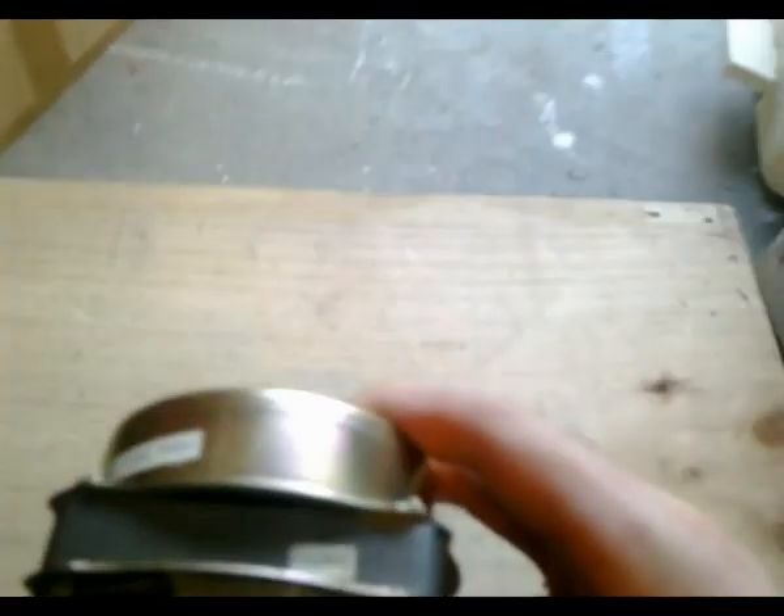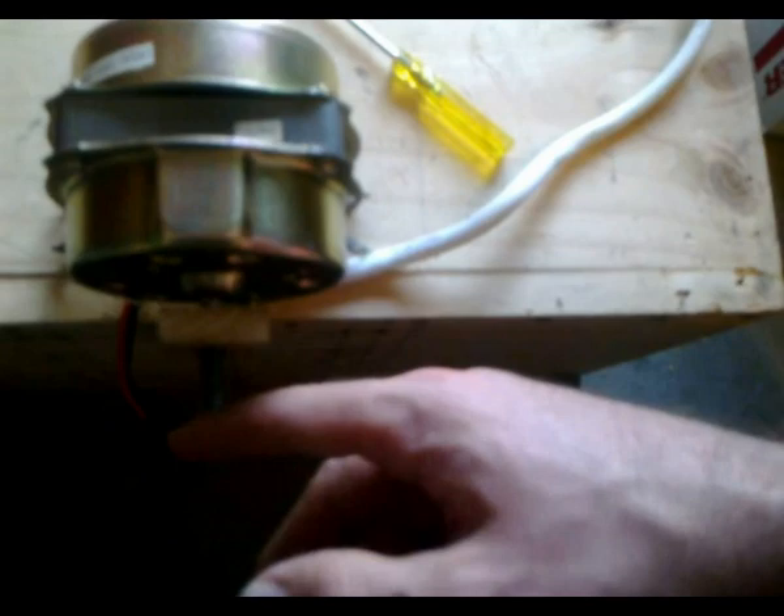What's going to be happening is I'm going to mount this motor onto a block of wood which will sit on the mechanical televisor — onto this piece of wood. I'm going to have it positioned roughly about here so there's a bit of space between the box and the mechanical disc. The disc is going to be mounted on here. I've put a wooden nut on there which I self-tapped, because I did not have a suitable size nut to fit the threading on the shaft. So the disc is going to go on here, stuck to the nut — glue will probably do the job nicely.